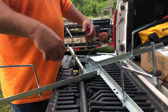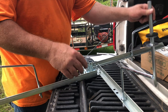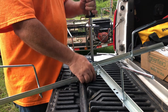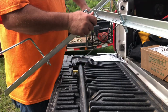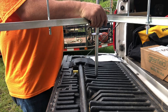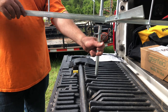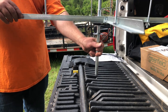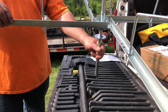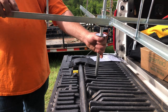That's going to keep the wire from unspooling or coming off the reel. The last piece is this spindle, which stakes down into the ground — drive it down with a sledgehammer on top, then set the spool holder on top of it. It simply slides in the bottom just like that. Once everything's attached, it will spin as you pay out your wire, turning to allow you to continue feeding wire as a one-man operation and to eliminate tangling.